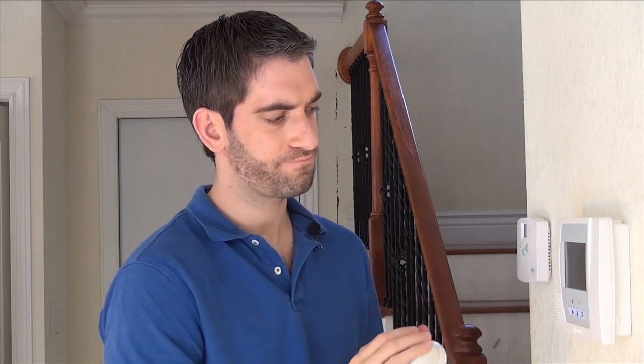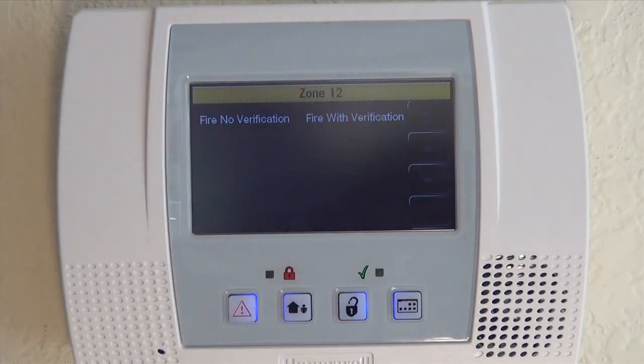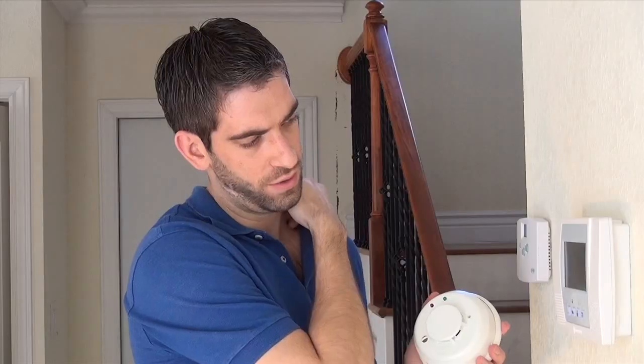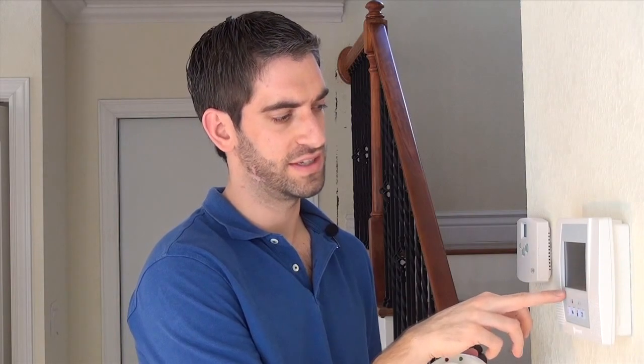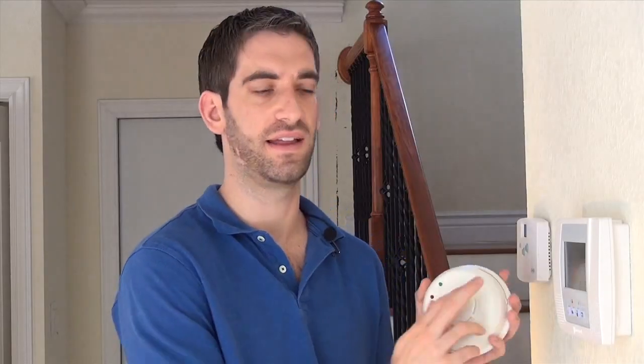In device type, we're going to choose smoke detector. By choosing smoke detector, we've limited the available response types to the two Honeywell zone response types for this sensor: fire no verification or fire with verification. For this sensor we want no verification — there is no verification with the Lynx Touch, which is actually the default option. Make sure it says alarm report yes. Chime should be no — there's no chime on this device. It should be supervised, which means the Lynx Touch will periodically check in with the device to make sure it's being seen and not outside of range. If you ever have an RF supervision error, the Lynx Touch is not seeing the device and you'll need to add a 5800RP repeater, or move your panel or smoke detector so they are seeing each other.